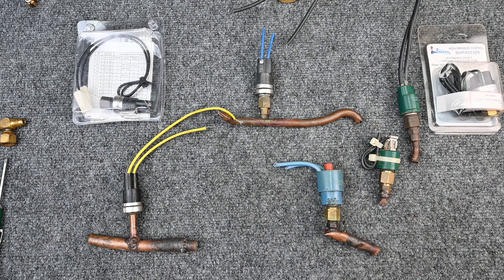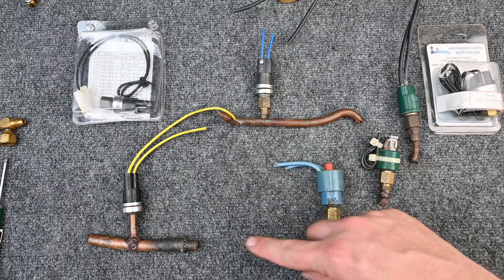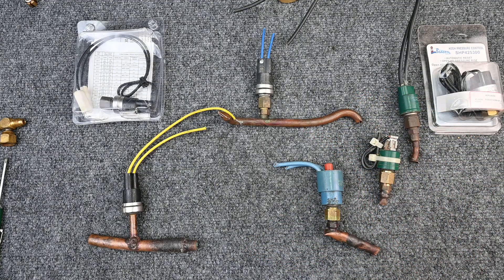As we go through refrigeration, you're going to see other accessories such as pressure switches. All of these pressure switches are on the small line, so they're going to be a type of high pressure switch, but they can also be on the suction side. We'll talk more in electrical class, but since they're on the piping I want you to get an introductory understanding so when you see it you're not shocked or surprised.